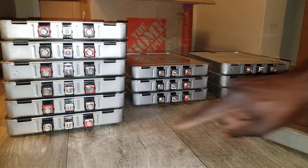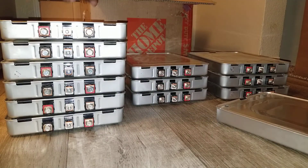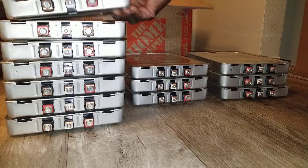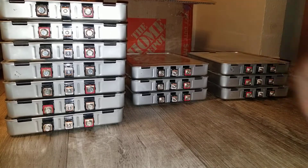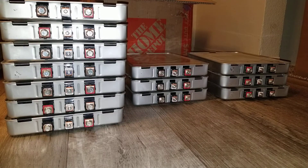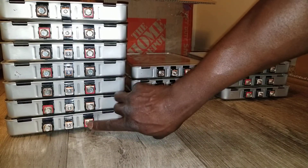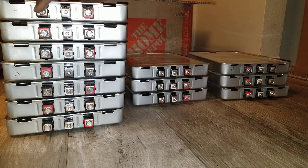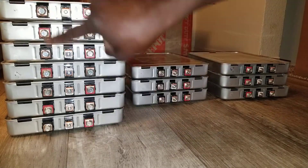One, two, three, four, five, six — one more battery to go. So we need a negative from this side here — this one here will complete the seven batteries the way it's supposed to be wired. 14s, seven batteries in series — it's just seven times two equals fourteen. Negative, positive, negative, positive, negative — same thing. We're going to be drawing from one end: the positive and a negative right here goes to the inverter.